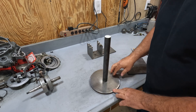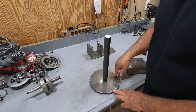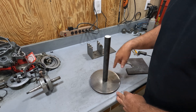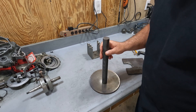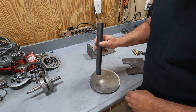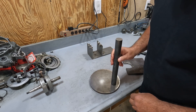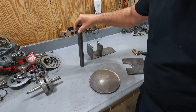What I've got for this is this eight-inch round steel disc, A36, and it's a half-inch thick. And I've got this inch-and-a-quarter solid steel. The plan is to make three separate bars that are adjustable to fit different size crankshafts.